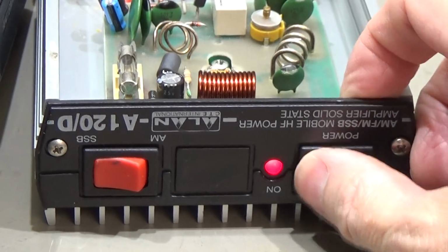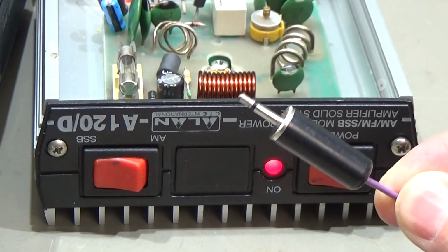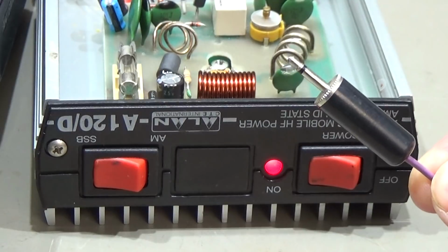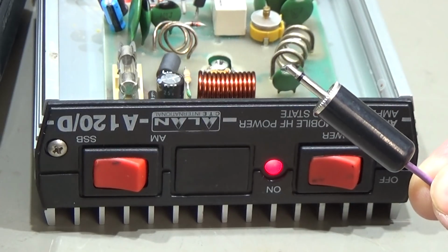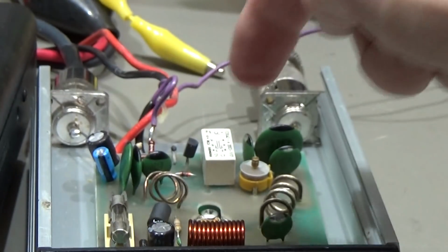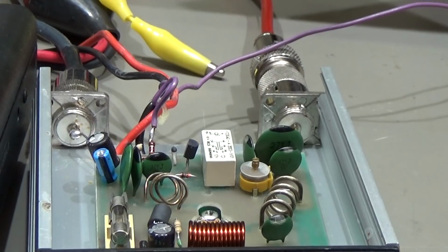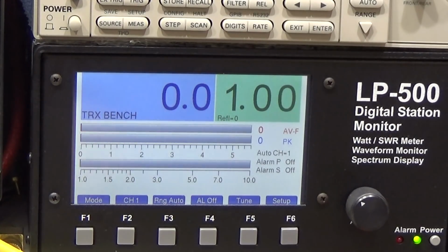And of course I can switch it in, and now I need to put this wire to plus, because that is normally connected to the rig which drives this little amplifier, and then our TX-RX relay here inside will switch, and then it is still working just a little bit. And that is what we see. Not really, it is dying more and more. You see 6 point, and now it is dropping. So a transistor like we have here in this little unit can't really work any longer.